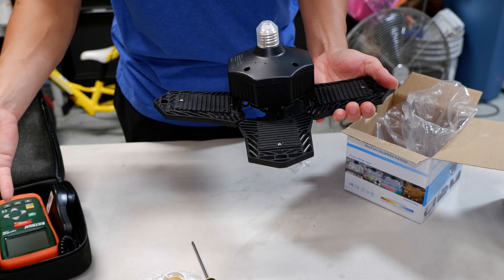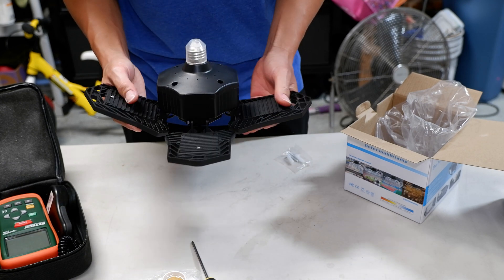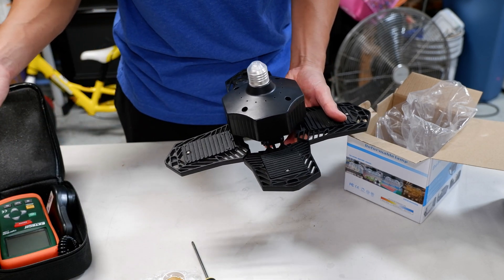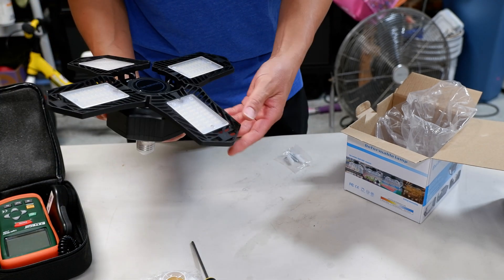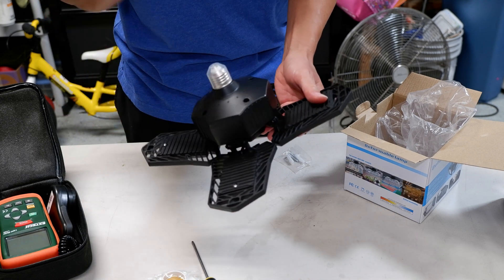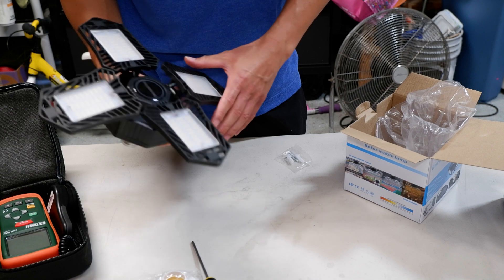In the industrial environment where I work and design for my clients, we're up to over 200 lumens per watt on those type of fixtures — but those are really expensive, like two or three hundred dollar fixtures, putting out twenty or thirty thousand lumens per fixture. This is more for your garage and simple DIY at home.